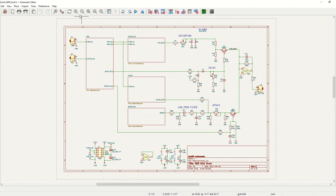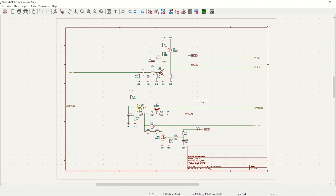Next page we have the trigger circuit. You can see the high and low triggers here on the top, and on the bottom you have the velocity-dependent triggers for attack and decay.